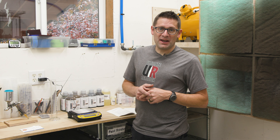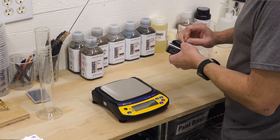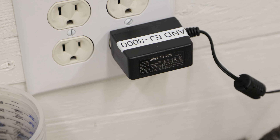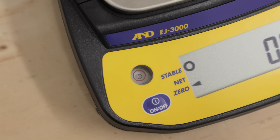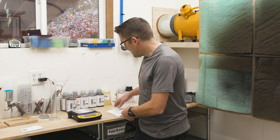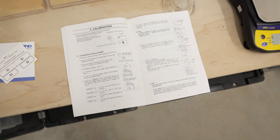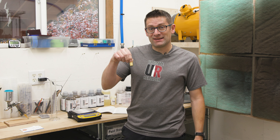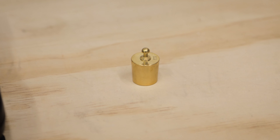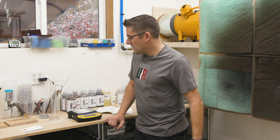I got the scale set up and calibrated — really easy process. Basically we put the pan on the scale load cell, plug in the power supply, turn the scale on, and make sure it's completely leveled. You'll want to allow it to warm up for about a half an hour, then go through the calibration procedure. Calibration is spelled out in detail in the owner's manual. You select what weight you're using. I'm using a 50 gram weight, which is a little on the light side — the default was around two or three thousand grams — so I might get a heavier calibration weight, but this should work nonetheless.